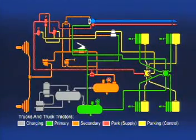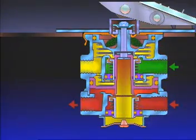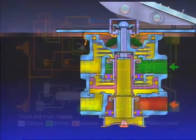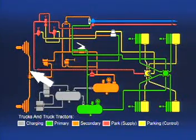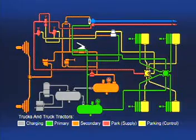The system discussed so far will stop the vehicle, but additional equipment will improve performance and safety. When the brakes are released, the air pressure from the pressure side of the chamber goes back through the exhaust port of the brake valve. As airline lengths increase, air travel time to and from the brake chamber increases. Worse still, as air pressure decreases, air travel time increases, as would be the case during a brake release. Timely release of the brakes is as important as the brake application itself.